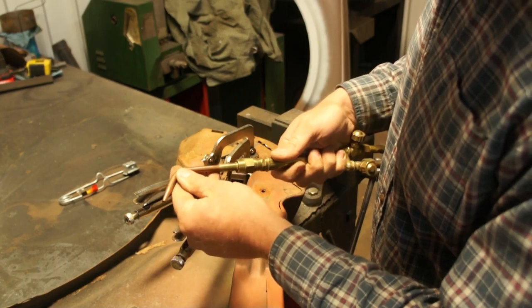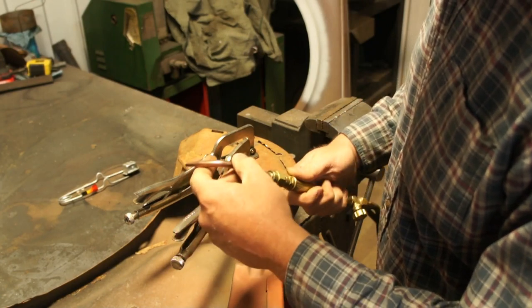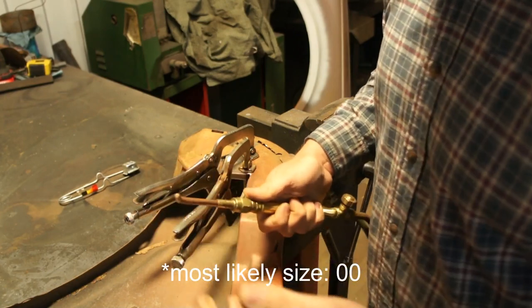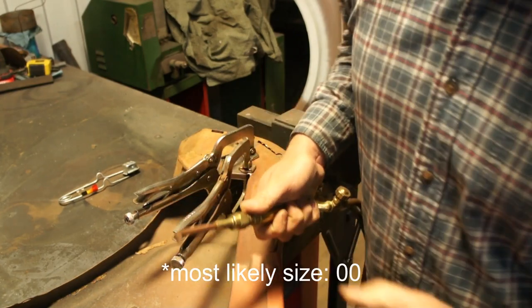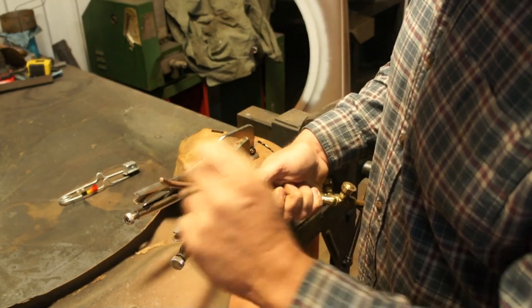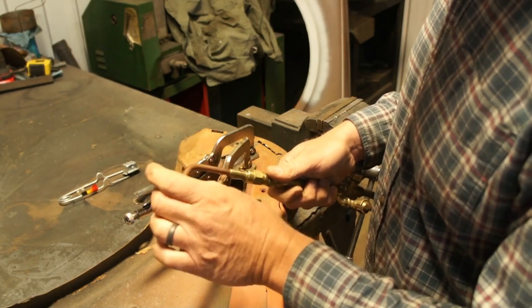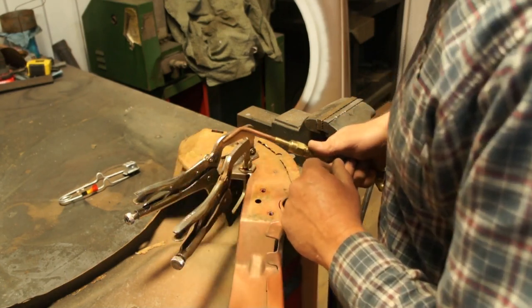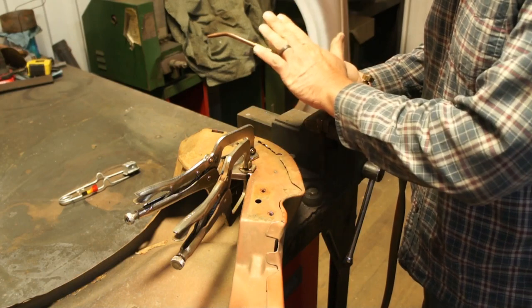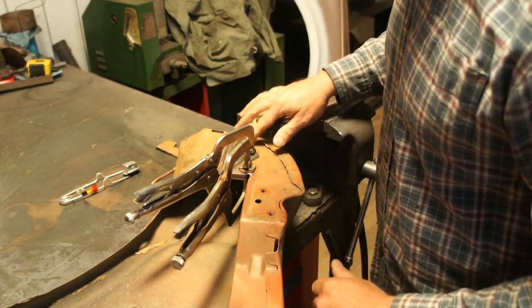To be honest with you, I am not an everyday welder — I have not made my livelihood welding. I don't even know the size of this tip; suffice to say it's the smallest one. The smallest tip cleaner needle goes in there, so it's very small. I want a very tiny, petite flame — not a lot of gas coming through at all. We don't want to heat it up more than we have to. So I'm going to get some wet rags and we'll light this thing up.